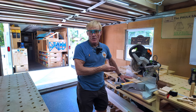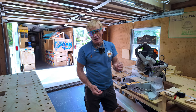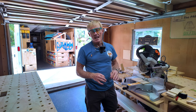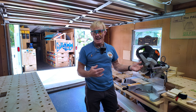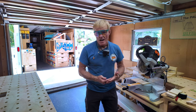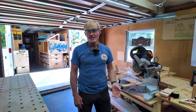As I said with the miter scale, if you check it with your two-cut method or four-cut method and you're very, very close, then don't adjust it. Chasing absolute perfection is a fool's errand. You're not going to get it — you're probably going to knock it off more than it is and then have to work to get it back in. We're working with wood. We're not building airplanes. We're not machinists working to five thousandths of an inch.